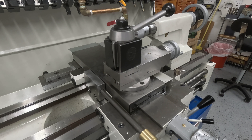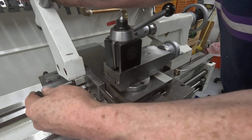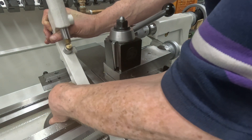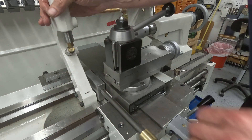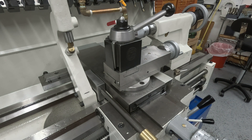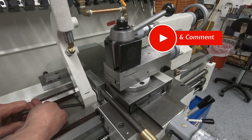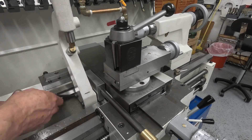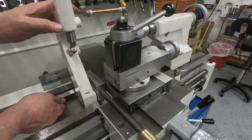Now, the follow rest. I need to shorten the screws for this, which I haven't done yet, but just to give you an idea how this works. It just mounts to the threads on the two custom bolts that were made earlier. And to keep everything within a reasonable span, the bolts have a kind of minimum thread depth, so I have to shorten these two mounting bolts.